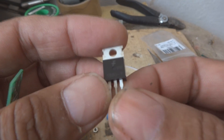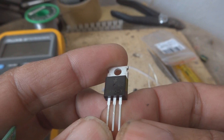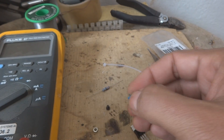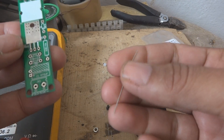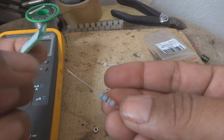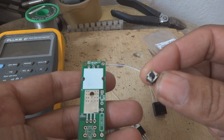And then the feedback winding. So these three are the windings in this transformer. We will fix this transformer on this PCB. Then there is a transistor, which is a 2SD880 D880 NPN transistor, which will be fixed on this PCB at this location. And here is the terminal block which will be used to power up this unit. Then here is this diode which is in the feedback circuit, as well as a resistor which is also in the feedback circuit. This is a 33 ohm, 1 watt resistor. And here is the switch to switch this unit on and off.